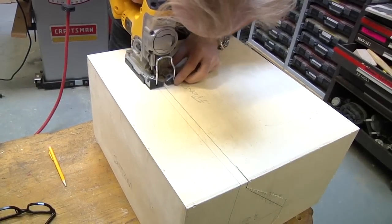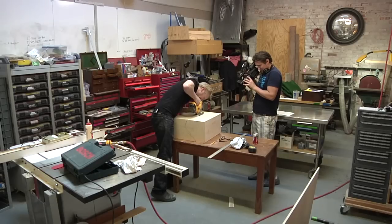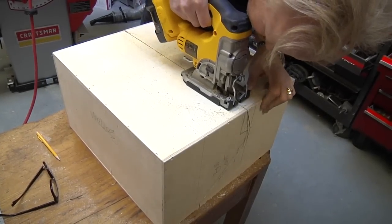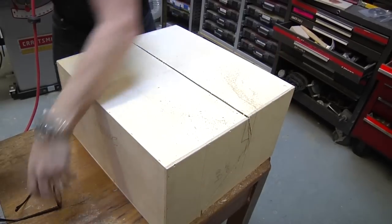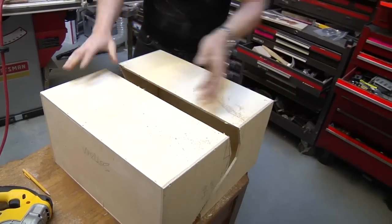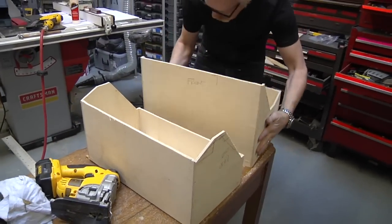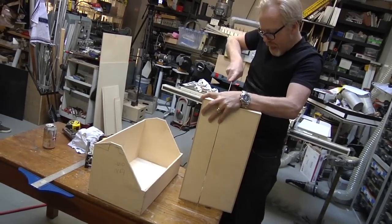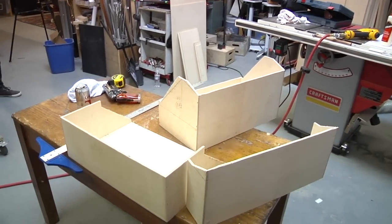You can see the top lid now. I'm going to cut this again — because of the way I've done it I can actually use the jigsaw and the kerf doesn't really matter here. And then beautifully, this one box now becomes a box and two lids. Because I made the whole thing contiguously at the beginning, I know these parts fit together just perfectly.